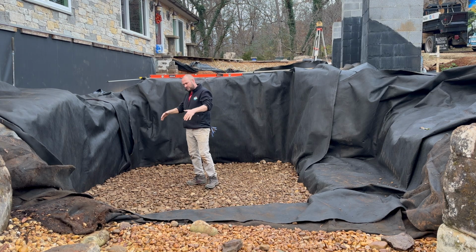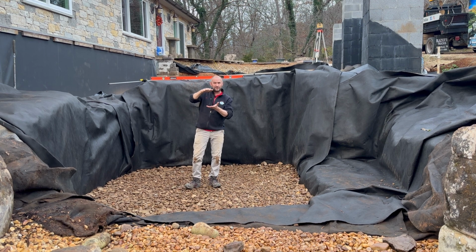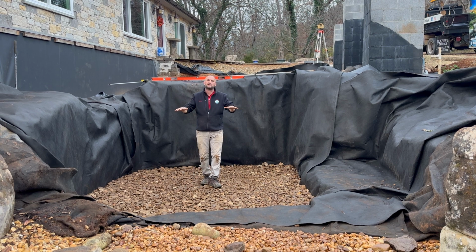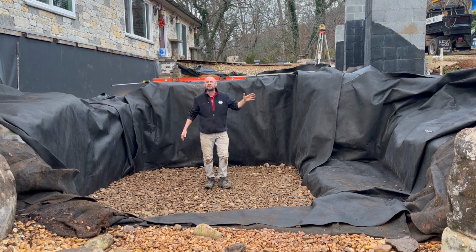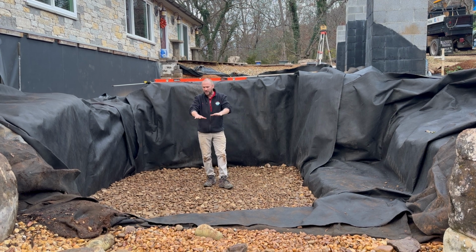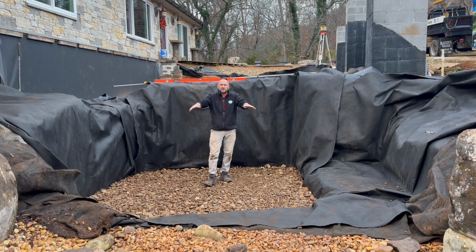We're putting another piece of rock pad on top of this gravel. We got a 6 to 9 inch leeway for gravel inside of here to just create a nice wide foundation, so there's no chance of any pinpoint sharp objects underneath. The vault weighs 12 tons without the lid on it, so it's heavy. It's going to sit right on top of this gravel. The weight will spread out evenly. We're going to get it nice and level in here, and then we'll just be able to backfill with gravel.